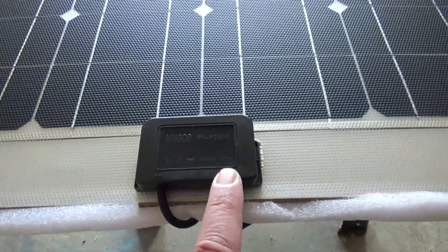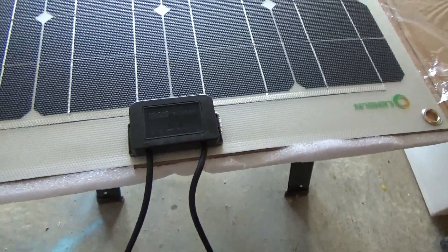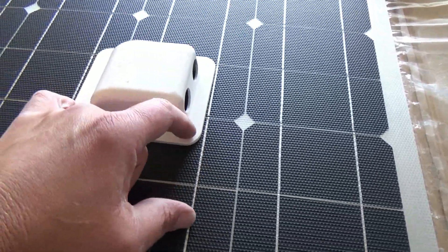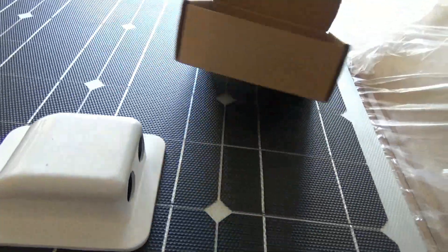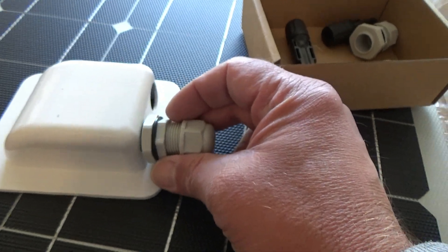The junction box is marked positive and negative, and our cables are also marked positive and negative. It comes with the ends which we are going to pop off because we have to punch a hole in the roof and install another box and put those through it. What I plan on using is a product by Link Solar. I'll put some butyl tape underneath, drill a couple of holes, fasten it down, and then use this tape that goes around the edge. There are some fittings that fasten into the hole, and then a compression nut — you feed your wire through there, and that's how it's installed.